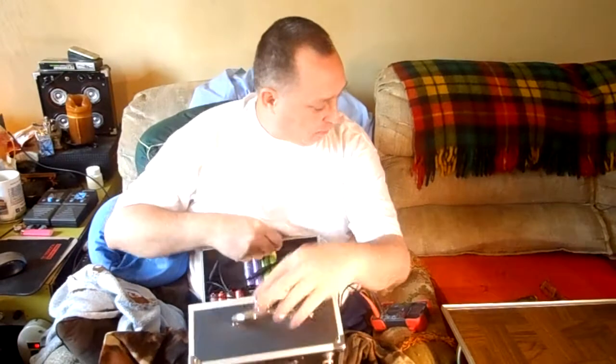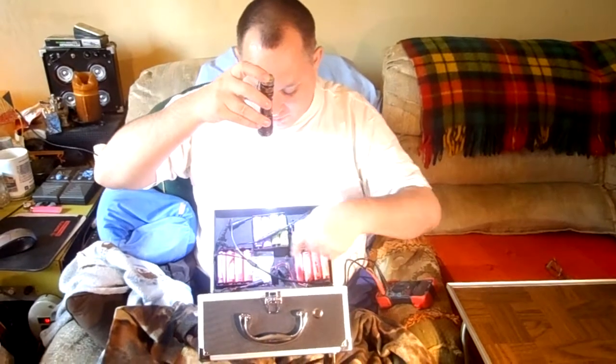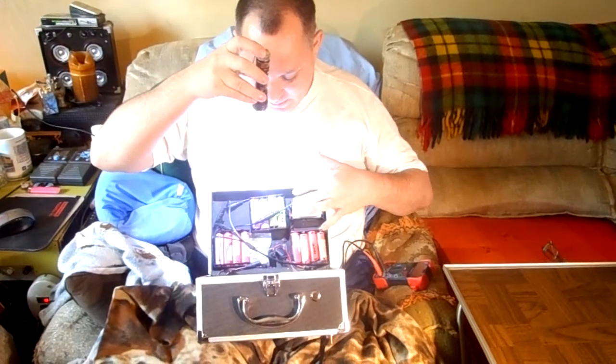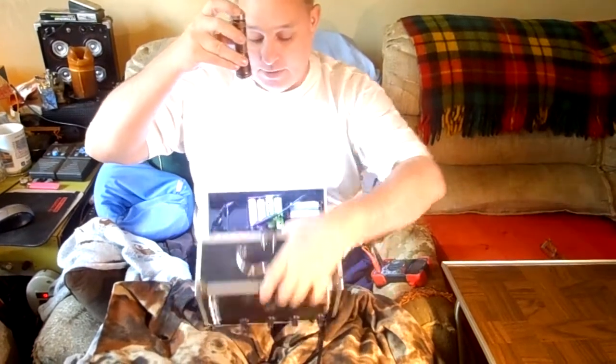So, how it is powered — I will get a light for you guys here. There are three 18650 x4 packs, and I'm running 2600mAh cells. These are 3200 and 3100mAh. There's some extra fuses in here, here's the output jack. These two batteries here run the circuit that does the VU meter — the bouncing LEDs.